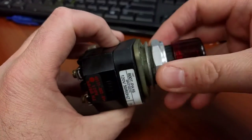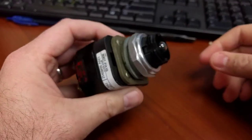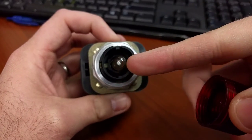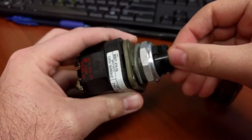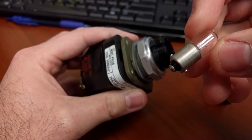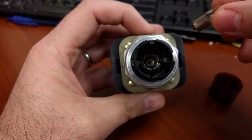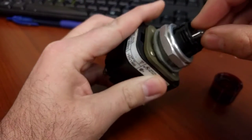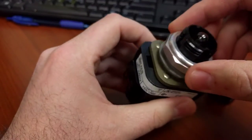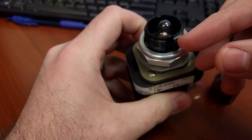If I was going to mount this into a box, I would first need to unscrew the indicator. This is a red indicator, and you can see the light bulb is in here. It just comes out by pushing, and you'll see it has a nice little bayonet base because that will allow you to push and turn. If I just push in and turn, it's kind of idiot-proof.